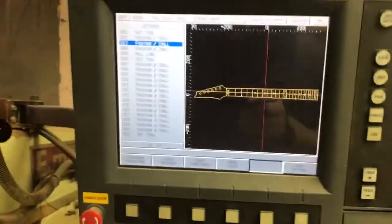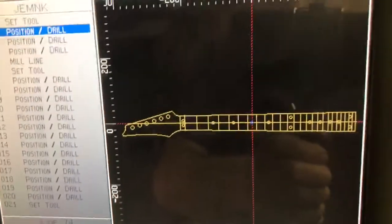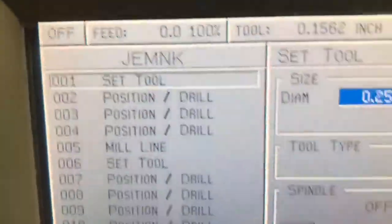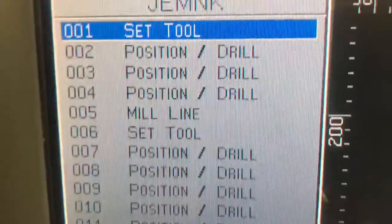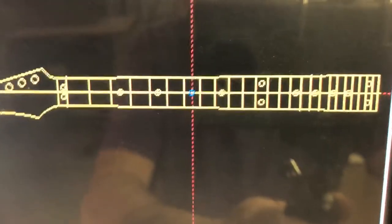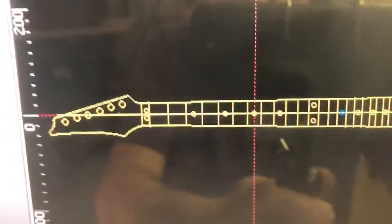This is the vacuum jig I made for this job. I'm making this neck here. There are three positions — you can see it says 'set tool' and that's a 250, which is a quarter inch. The three positions turn blue: that's zero-zero-zero, then the third fret, and the fifteenth fret.